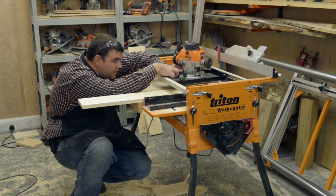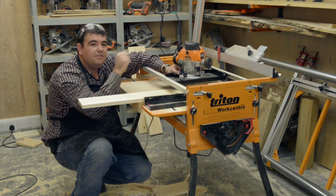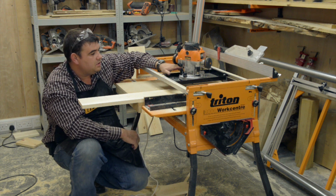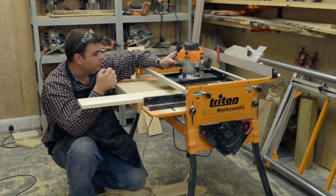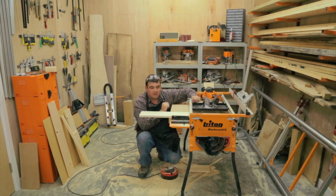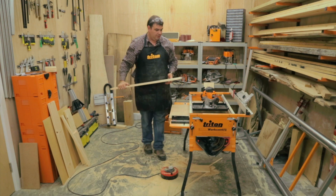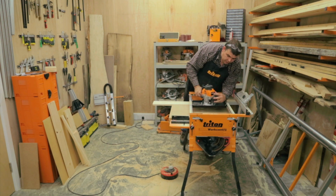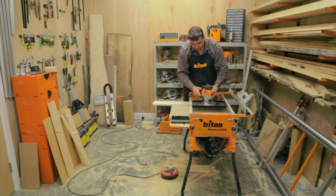And then on the turret over here, there are a couple of scales over here. So we're going to set this scale here to exactly 5 millimeters. Turn it round, and that spring-loaded post over there is actually hollow. So now we can plunge the router down exactly 5 millimeters. Okay, so we've got to have a 5 mm rebate all the way there. I'm just going to do a cut in my fence there quickly, so that I've got a reference as to where we're cutting to. Okay.